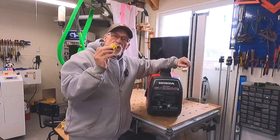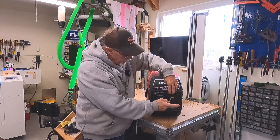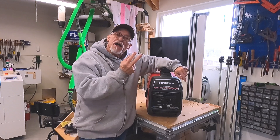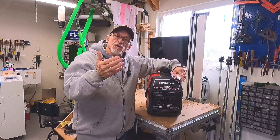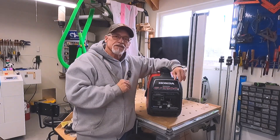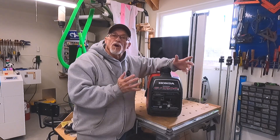What that does is when I take this neutral ground bonding plug and plug it into the generator and leave it in there, I'm going to plug this one in one spot and then my extension cord going to my furnace is going to go in the other slot. That ties those two together and it satisfies the ground requirement that your furnace is going to have. I've tried this on my furnace and several other furnaces on friends and they all seem to work fine. Once you do this, you have no problems with running your generator.